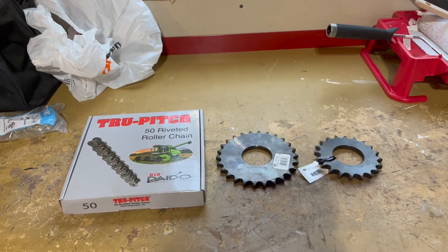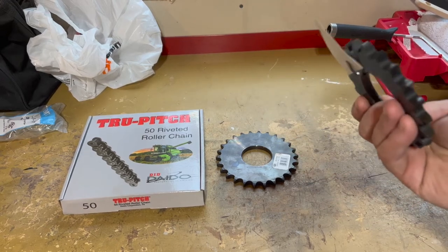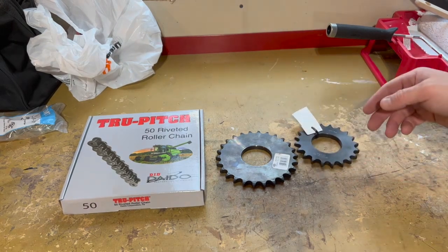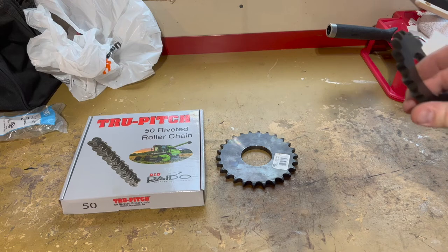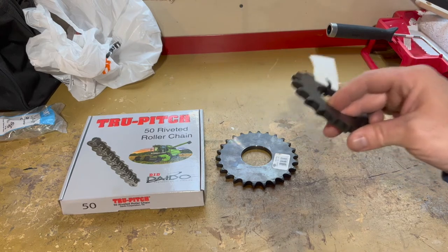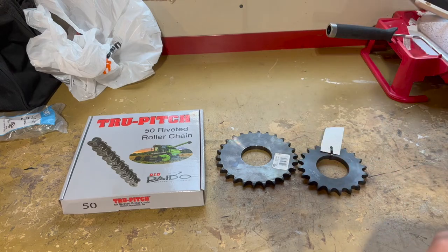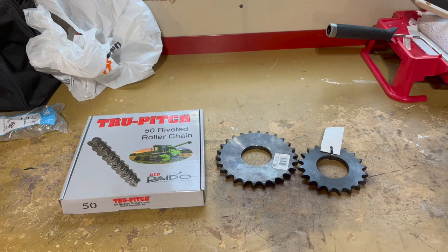Here is my secret weapon for rolling up and down my screen. Those sprockets are beefy — these are 50-pitch chain. The reason I went with this overkill size is I don't want a lot of tension on my chain because my structure isn't built to handle chain tension, so these are extremely overkill to make sure my chain does not skip. The other thing is, these were on clearance — one was $4 and one was $5. The most expensive part was the chain at about $20, so I've got less than $30 in this whole setup.